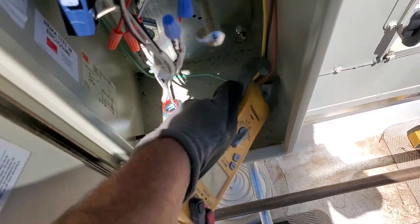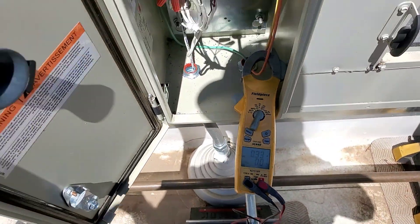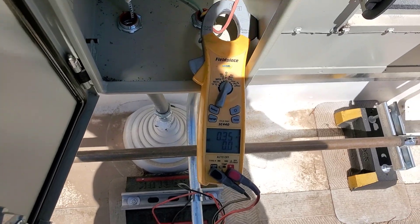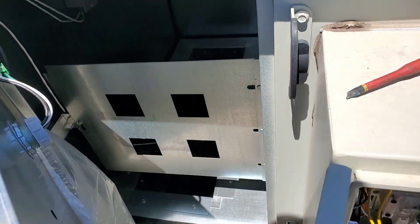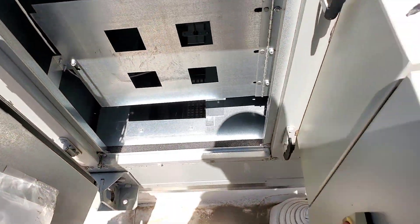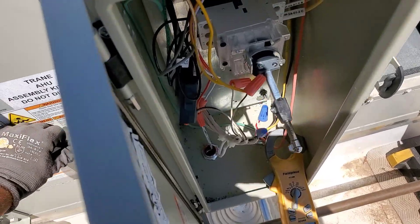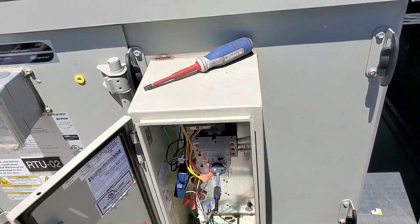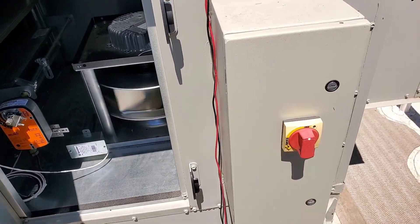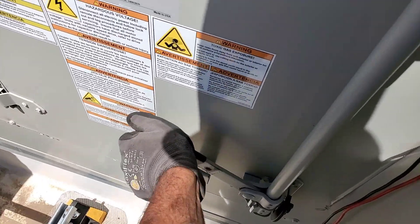About 0.35, 0.32 amps - closing the cover should bring it up a little. There isn't really any ductwork, it just blows out right down there into the room. They had some weird power issue here - somebody had the cover off that unit down there like they were looking at it. The exhaust return fan is running. No transformer in this compartment, there's one in there, but I don't know what they were giving 24 volts to because the Trane controller was lit up.